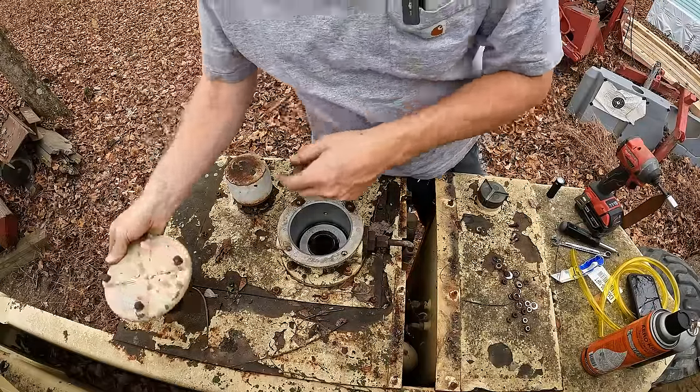All right, so back on the engine side here, I ended up pulling a new fuel line from the fuel tank over to our lift pump here, because when I was messing with the fuel tank over there, I saw it was kind of cracked up. So here's the old fuel line. All I did was tape the new one to the old one and pull it through. It was kind of a pain, but I was able to get it done pretty easily. Got that cinched up on there, so the fuel line is completely empty. We don't have to worry about any crap in that old fuel line. I'm gonna loosen up this bleeder screw here, and we should be able to start cranking the engine over and let that fuel pump do its thing, and we should be pushing up through the filter and getting this thing primed up.